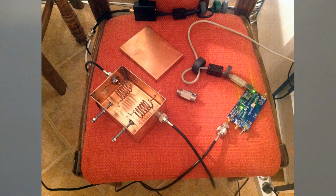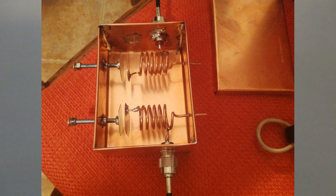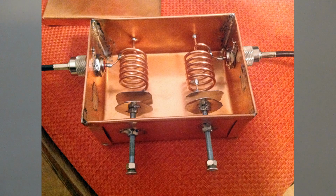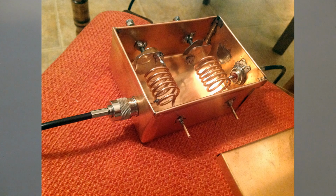One must be very careful using other variable capacitors instead of my suggestions here. There is very high RF voltage on these capacitors. For example, when I was making experiments using 2 pieces of RG58 coaxial cable, 16 millimeters each, which is about 1.6 picofarad, and I applied about 8 watts RF power on 145 MHz, the coaxial cable pieces simply burned immediately. You can imagine how high the RF voltage is here, because the maximum voltage by producer specifications for RG58 coaxial cable is more than 1.4 kilovolts.